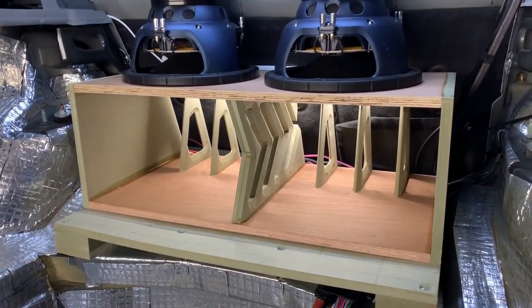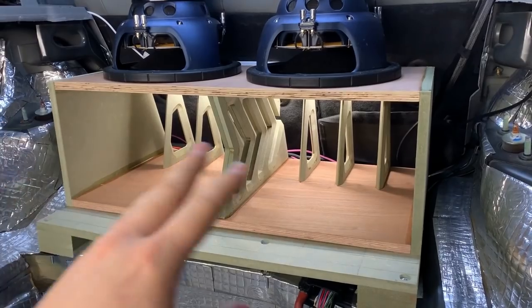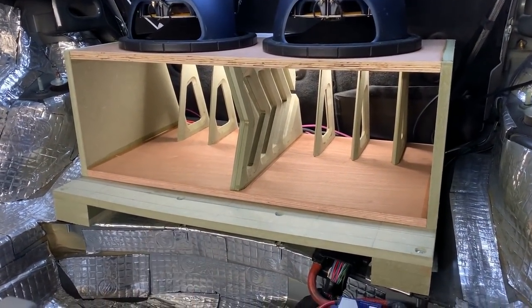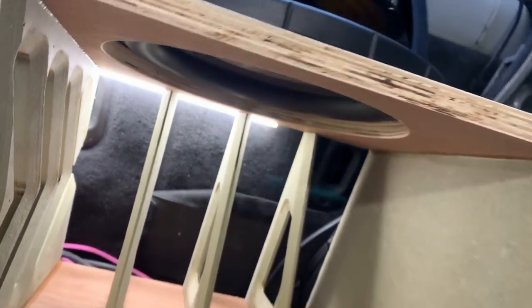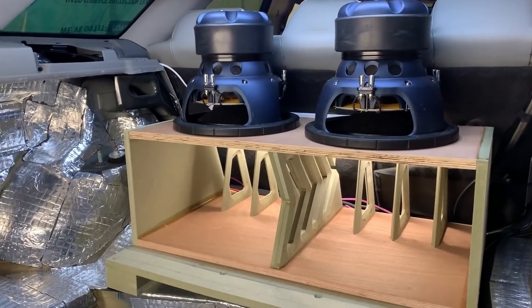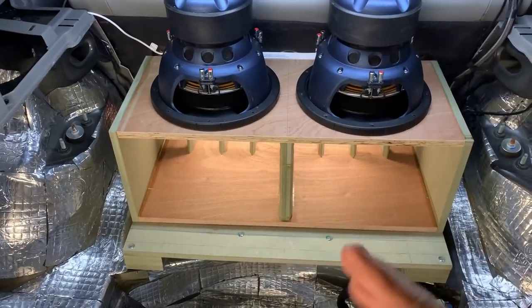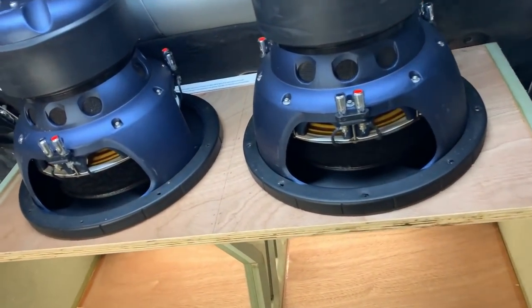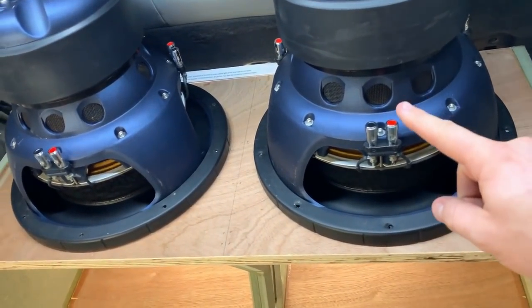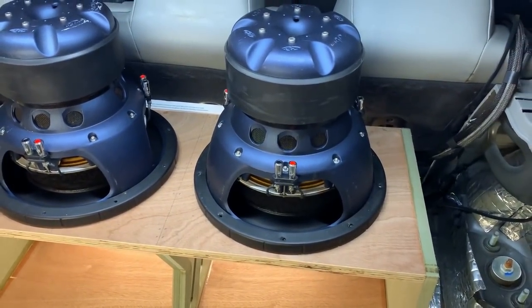You can see the bracing inside. When I place the subs the other way around you can't see much of that bracing — there's going to be perspex right in front of it with artwork, but you'll still be able to see through to what's inside the box. If I keep the subs facing up, I could place a mirror to the bottom of the box so when you stand here you can see the cones from the mirror moving. You can also see the magnets with lights placed to show certain things like the spider of the sub — there's a second layer of the spider too, because this sub has two sets of spiders. It's a dual-core sub with an extra terminal for the lights on the cone.